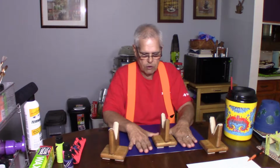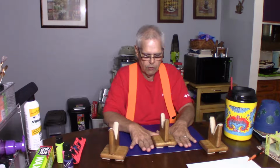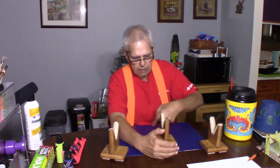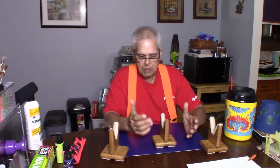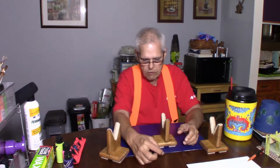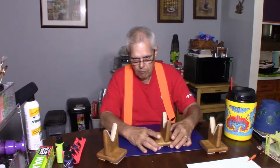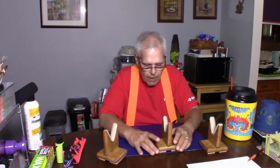parallel square straight edges, and you capture your stock in between them, and you put a number of pieces on there, and then you make your marks on the top. You take a T-square, put it on the top, run it down, and you draw your marks, and they're all in the same spot because everything is parallel. In the same way, if you have some type of spacer, you can run along the side of it with the T-square and make your marks as you go along your pieces, provided you know where your piece is located. Although it's just as easy to twist them around the other way and set your other marks up the other way.